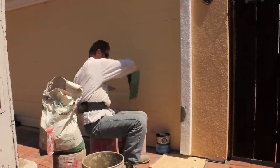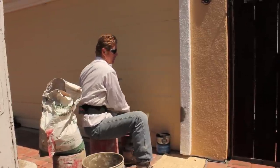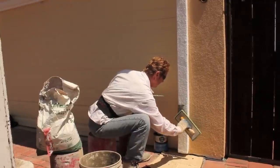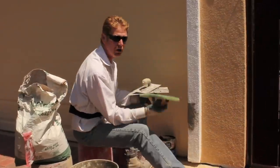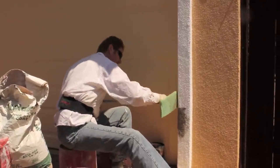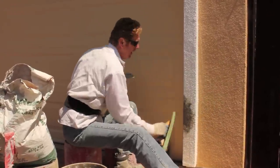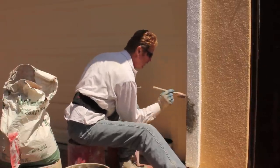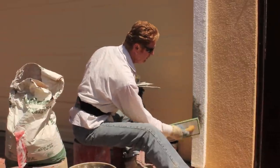Now what I'm doing is water — there's water in this bucket. What I'm going to do is just match the finish here. This is pretty simple for a skilled fellow. You just pull it like that, bring the aggregate out. Aggregate's just a fancy word for sand; in concrete it's a fancy word for the rocks. And I float this — I'm floating it up, I'm floating it down — just bringing the aggregate out. It will adhere to here because I use weldcrete. I put the weldcrete on this; if I didn't put the weldcrete on here, any excess would come off.